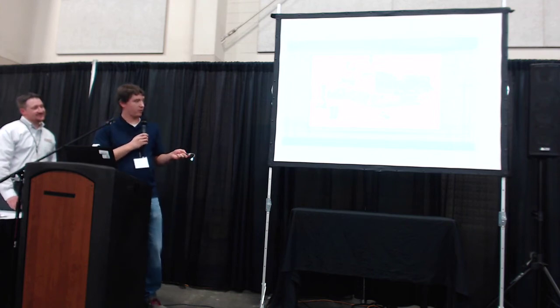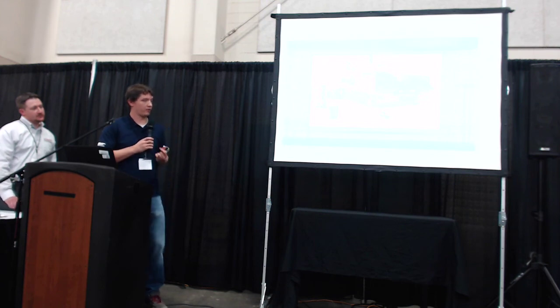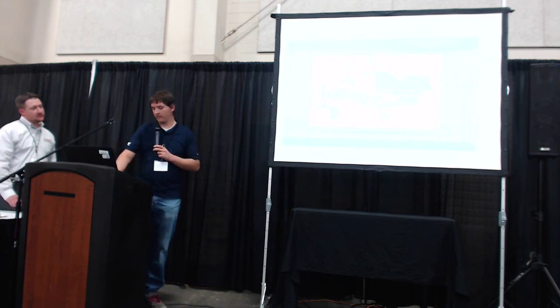He's right there waiting for the paver to go over it. He's got the plate there you can't really see, but he's holding on to it. If you notice, he made sure that it was on a clean spot. If you ever are going to sample the asphalt, make sure your plate's on a clean spot. You don't want to set it on anything like that because the plate can move and cause problems. It can even get sucked up into the augers of the paver. Not a good idea. Make sure it's on a clean spot if you're going to throw that plate and sample.